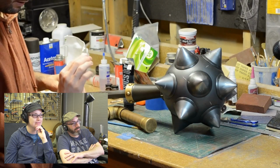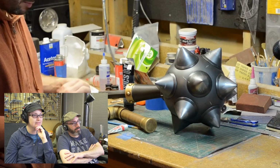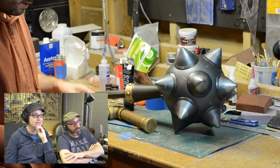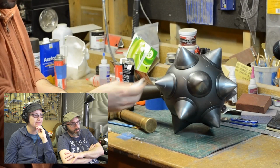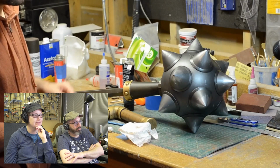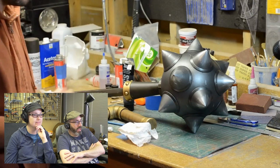Touched with a little bit of this, and really a little bit because this goes a very long way. Usually I'll just use a paper towel to apply it. I'll put a little bit on the paper towel and then just sort of, as the name would suggest, rub and buff it on the final surface. After that, the whole thing got a good couple layers of clear coat, and I let it dry. And that's it. Voila! It is done.